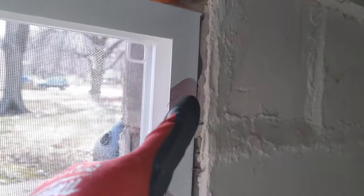Unfortunately the footage of me cutting out the old window is missing — I don't know what happened to it. Basically I left the wood on the top, cut out the wood on the sides and bottom using a reciprocating saw, then just pulled it out. It's not hard at all. I made a cut on each side, pried it away from the wall, pulled it out, and the rest just came out. Hopefully this is helpful — if you have any questions just let me know in the comments. Thanks for watching!